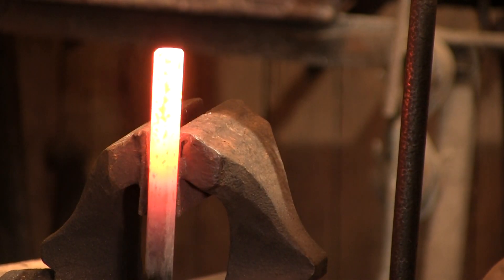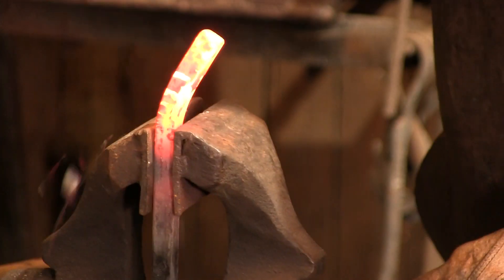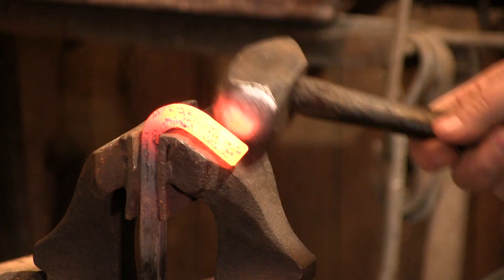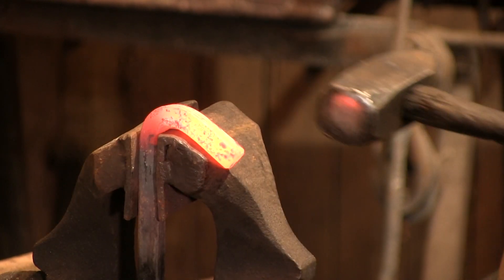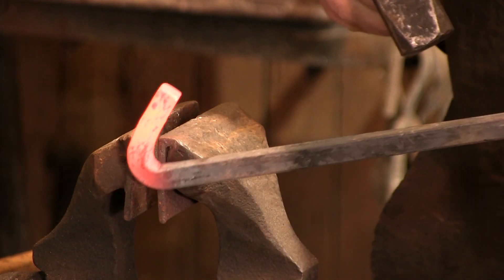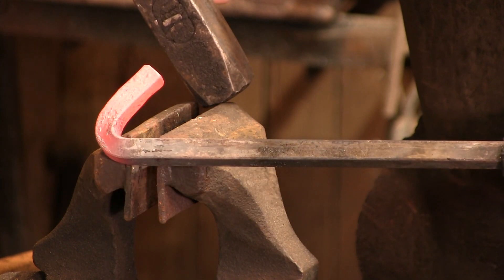Measure off two inches, slide this guy in here just like this and lock it in — no problem. The cool thing about the vice is that the jaw really fits that crook. You can tighten this up a little bit on the anvil if you want to, but most of the time the actual contour of the jaw is just what you want for your tent stake. So I'll flatten that out, because neatness counts, and we'll take a look.